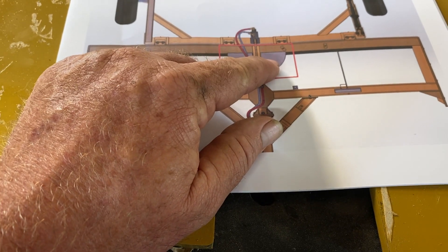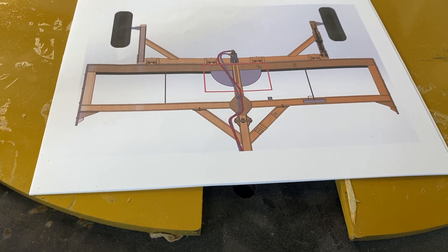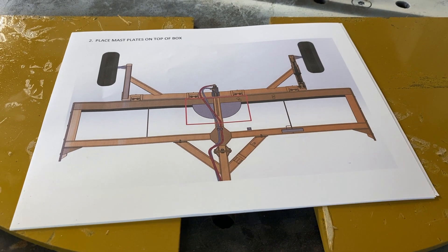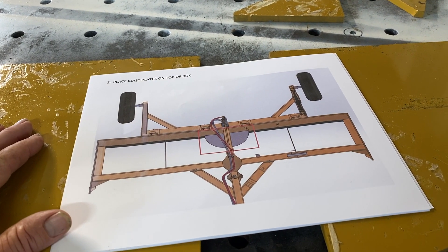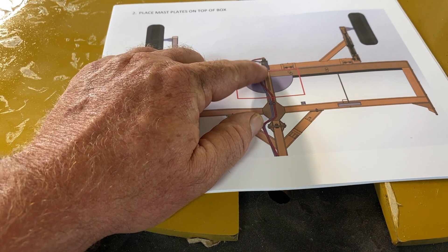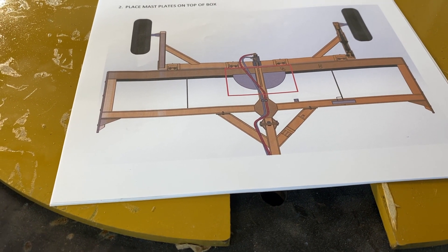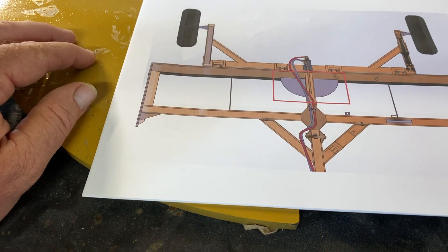The mast for the laser receiver — what we're doing on this box blade is we're putting a laser system on it, so we'll be able to go fully automatic. Normally Rome would build this in-house, put this kit on there. But since I ordered it out of a dealer in Louisiana and had it shipped up here, Rome sent me the plates direct. They're putting together the laser-ready package — that'll consist of a hydraulic valve where our hoses for the up-and-down cylinder get rerouted, and it'll mount on one of these plates. The other plate is where we'll mount the mast assembly for the laser receiver. We can mount all that on the job site once it comes in, and we'll just drill the holes into these plates.